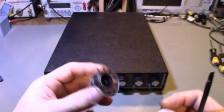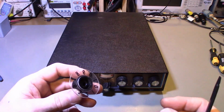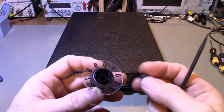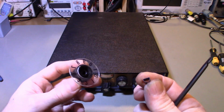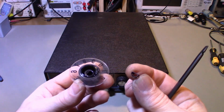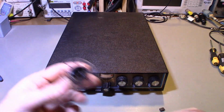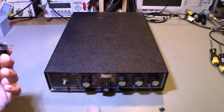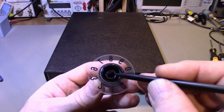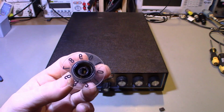Okay, most knobs, now what I'm going to show you works on pretty much any plastic. But what these knobs have, if you're not familiar, is what they call knob springs. So that goes in, and that's basically a reinforcement, fills in the gap too, which slides over the shaft. But yeah, this one was literally falling off. You just tap the radio a couple times and the knob would fall off because these ears had bent out. It had progressed so bad.